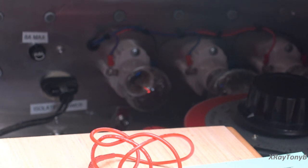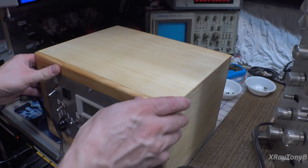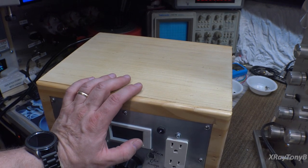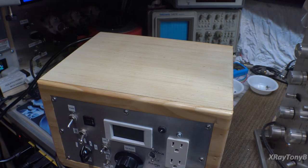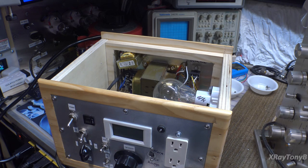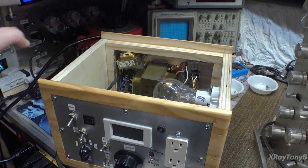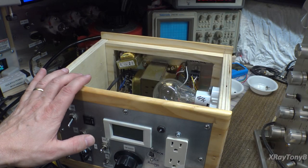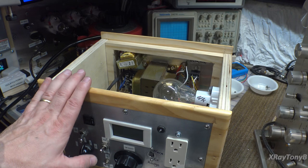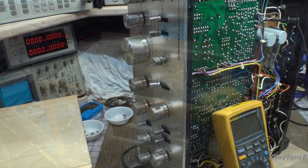A little more about this: the electronic circuit breaker will shut things off very quickly, but a very low-amp fuse could still pop. If you want to limit the current rather than just shut off at a certain level, you need a current-limiting device. Inside this light-bulb limiter is a big 118-watt bulb — I wanted a much smaller one since this thing doesn't draw much current. But anyway, sometimes you need both the breaker and current limiting together.